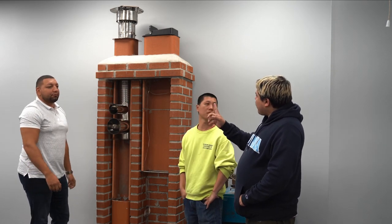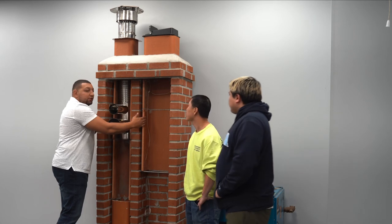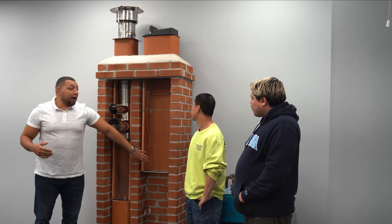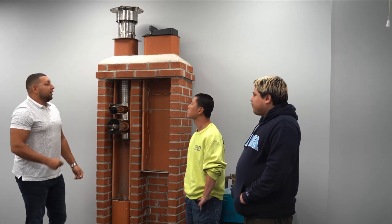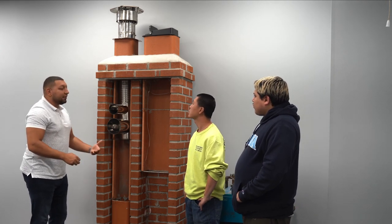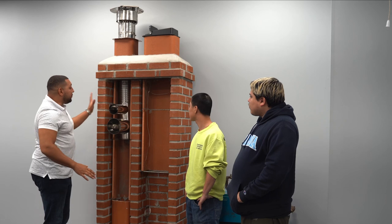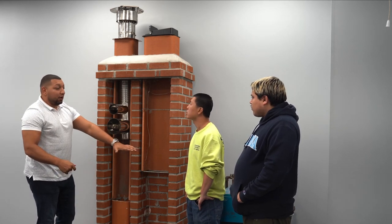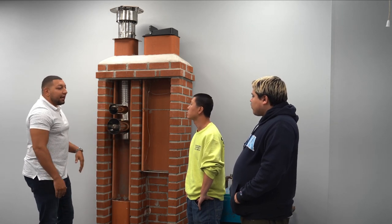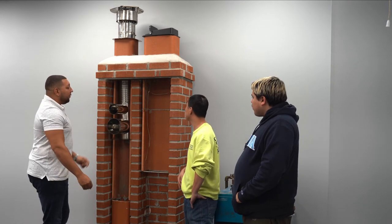And do all homes have that terracotta? Sure, yeah. So not all homes do. If you have a very old home, chances are probably not going to have a terracotta flue. Let's say your 1800s home, right? So not going to have a terracotta flue. It's probably all masonry inside. Homes that are built in the 1900s, newer building code, they all have this as standard. So when they build the home, they don't know what size units are going to be in there, but they know that basically these two cavity sizes carry the most likely probable BTU range. Okay, that's good. Got it. That makes sense? Yep.